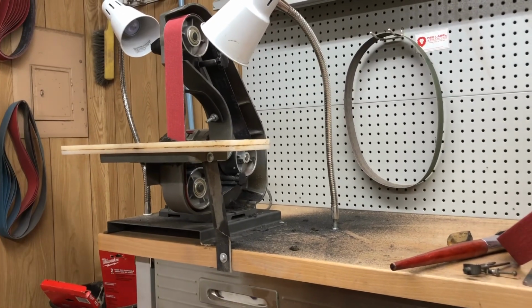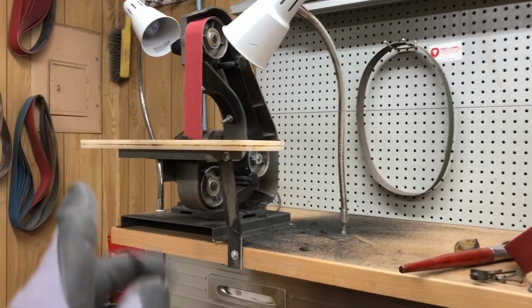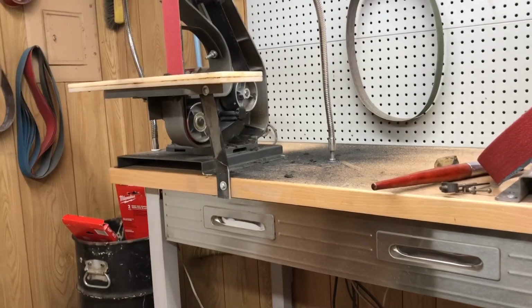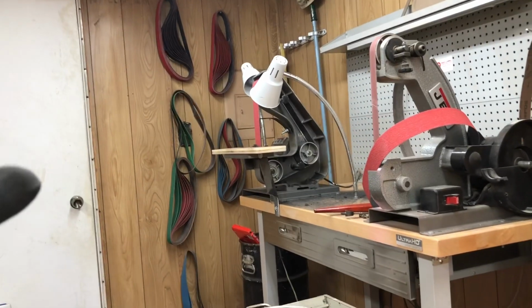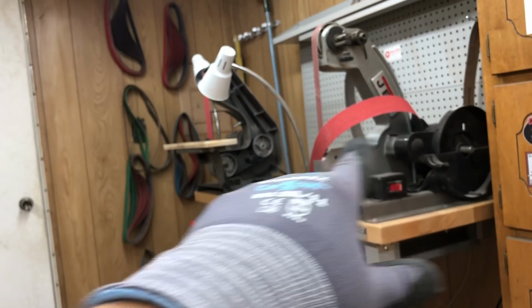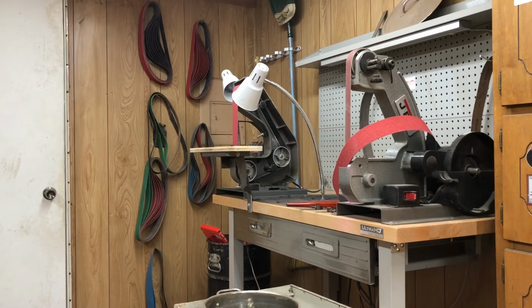I had to be really careful grinding. They ground so much material off so quickly that I had to really slow down my grinding, my bevel grinding process, because the bevels were getting away from me, which is nice. And the thing is, I've ground 4 knives on this, and normally I would have gone through a belt by now. These belts, this one here, that's not on, that's the 80, that's the 120. They're still like brand new. I am 100% sold on combat belts.